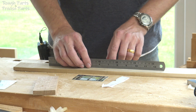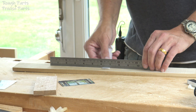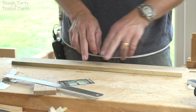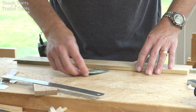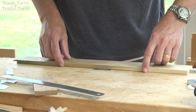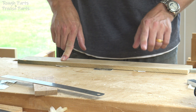I'll flip that over and put the plain side down so it's flat. As I said, this will flex, so let's put some support underneath. The credit card is just fitting under there — I want to put a bit more support, probably another two pieces, to stop it flexing. I'll also do some paper shims. So I've got paper shims here and here, and the plastic credit card shim in the middle — that's now not flexing, at least certainly nothing like it was before, so we can plane that flat.